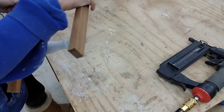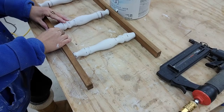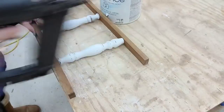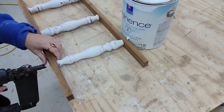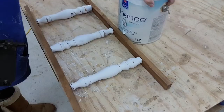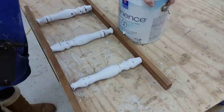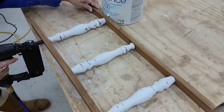I do all one side and then turn the whole piece over and do the other side the exact same way. You put your piece where you're going to be nailing and bring it to the edge of the workbench so you can properly position your nail gun — you want to keep it as straight as possible so you don't get any wonky nails, because it's hard to fix that when putting a ladder together. For a bigger ladder, just make your side pieces bigger and add more spindles — I usually keep my spindles about a foot apart on bigger ladders.